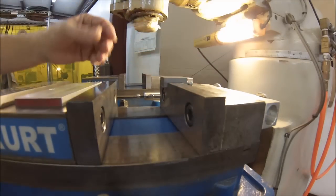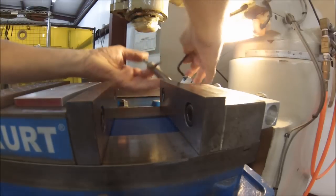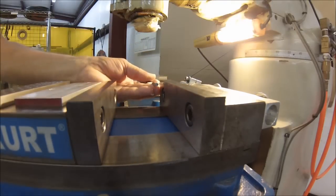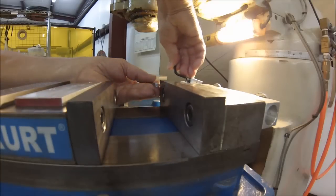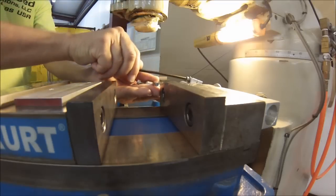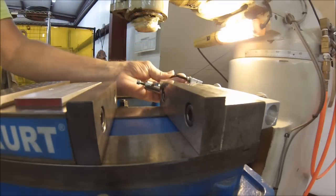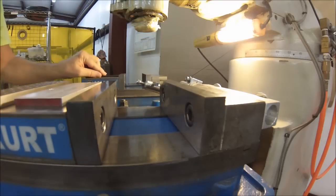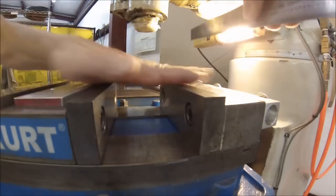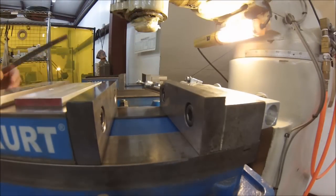I like vise stops, but they're not always practical. Let's imagine you have a much larger piece and one of these neat little guys tied to your vise in the back. I bend my rods like this for a specific reason — so that if I have a part in the machine that I'm trying to deck off and clean up, I don't want to worry about the fly cutter banging into anything. You deck across the top of that part, everything is out of the way, and it's easily achieved by just bending your rod. Simple.